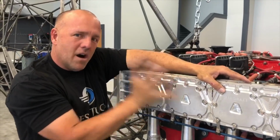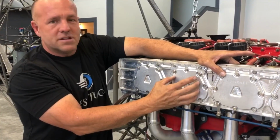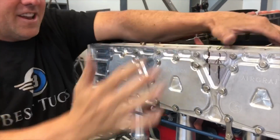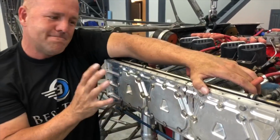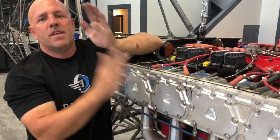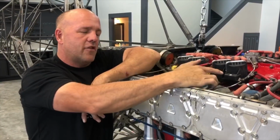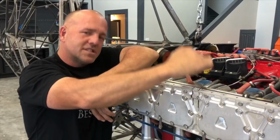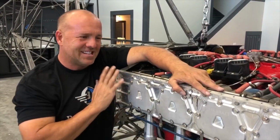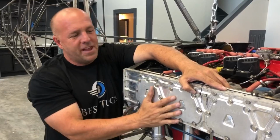So I took modern day technology, made my own part, and machined it. These big indents go in and hold the rocker pins and this whole assembly inside here. So it's really complex inside and outside. On the inside of this, I put cooling fins, and this doesn't have a gasket on it. What I did is put an O-ring that's embedded into it. So what actually happens is the aluminum of this head locker mates up and touches the aluminum of your cylinder head. That allows the heat to transfer from your cylinder head out into this plate, which has cooling fins on it. That also allows the heat from this cylinder to migrate to this cylinder. The purpose of that is to even up the cylinder temperature. So this was strictly for race reasons that I designed and built this. It's worked unbelievable. I've never had an oil leak.